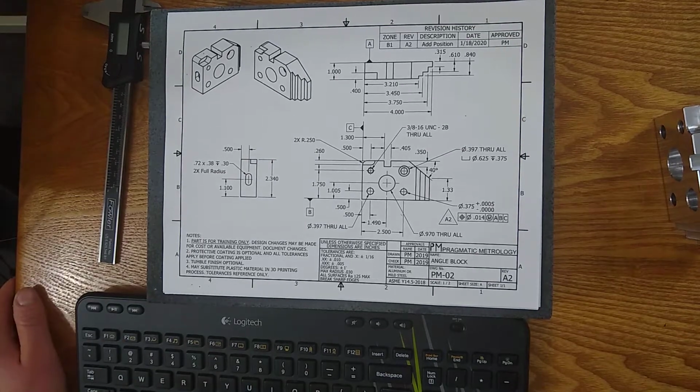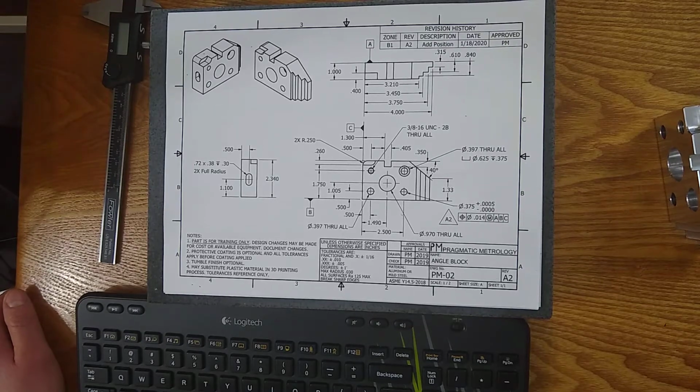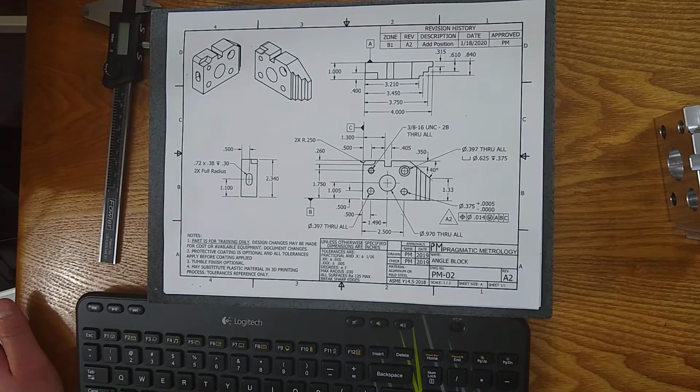So I would say out of the title block, most important things, first of all, drawing number and revision, and the material and the finish. You want to make sure that they grabbed the right material, they finished it correctly, and the standard title block tolerances. Those are going to be the most relevant to what you're doing every single inspection. The other things are also important, but hopefully everything is good in that sense. But every time you pick up a print, you're going to be glancing at material, drawing number, rev, finish, standard tolerances.